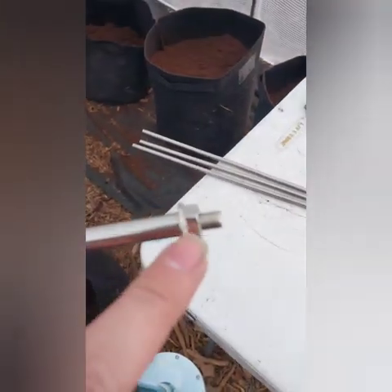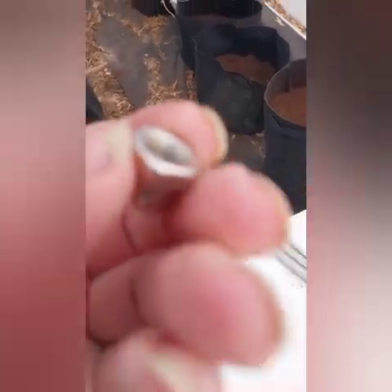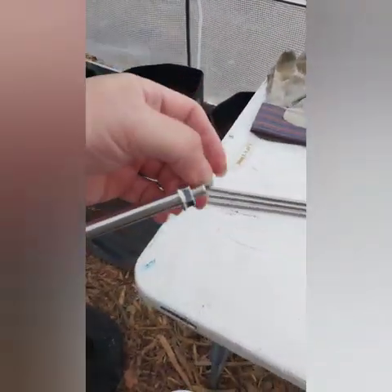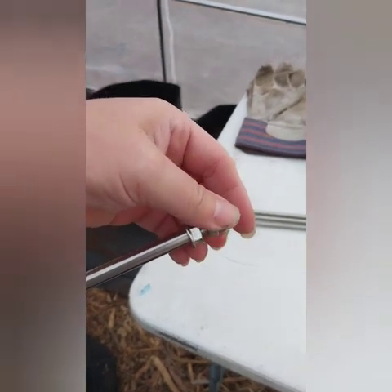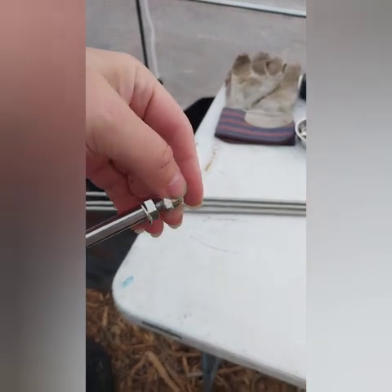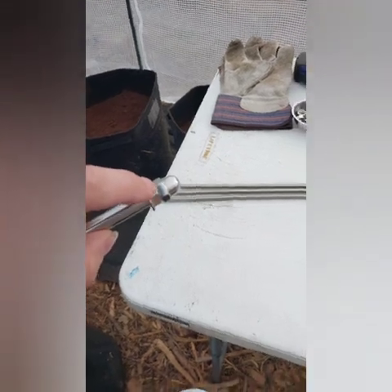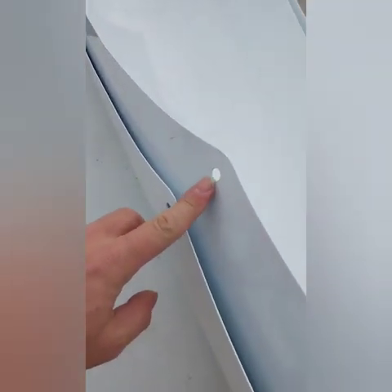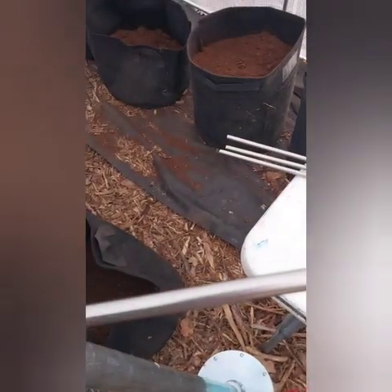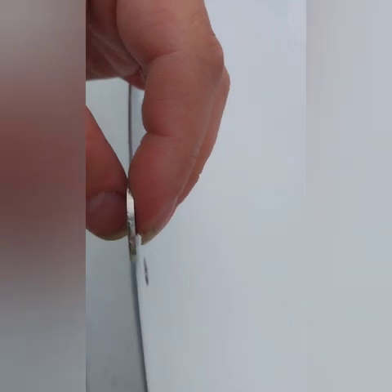There is a brief instruction depending on who you buy this from, and it'll show you: the threaded rod goes in the hole like that. That metal wing part goes in between here, and you'll have one of these washers in here. You can bend that washer a bit to match. This washer goes behind that, then you'll have your threaded rod protector — you might want to seal the ends in case water gets in — and then a nut at the end. Then you take that acorn nut and thread it on the end. Right in between there you'll have that metal sandwiched. The thickness of that washer and the thickness of the metal are about the same.